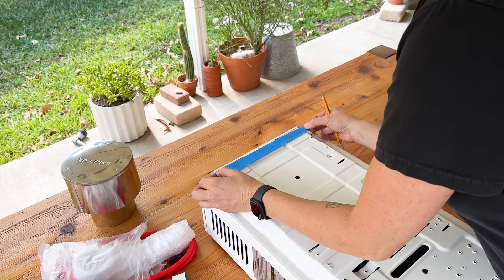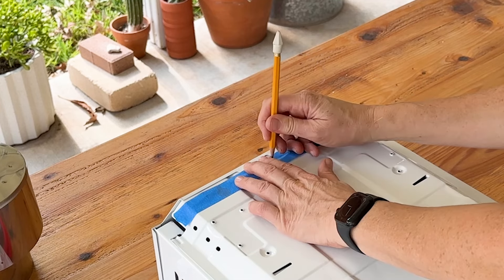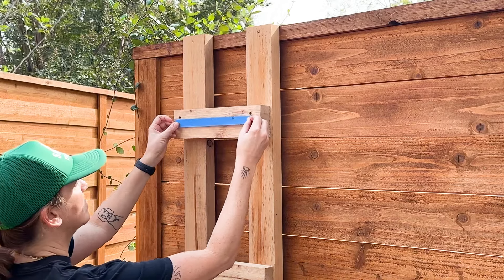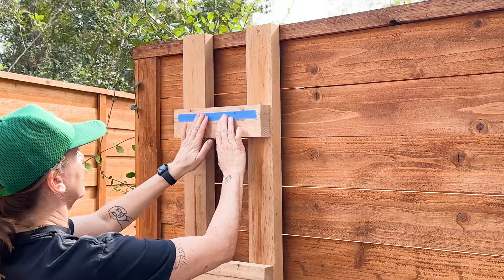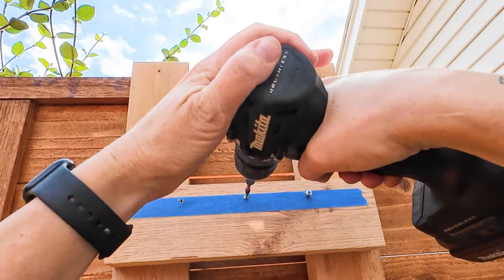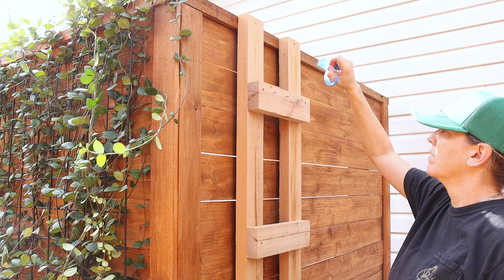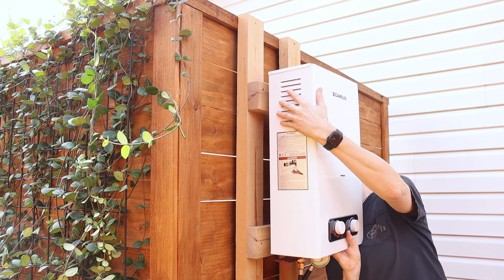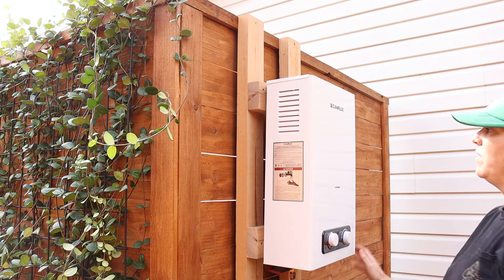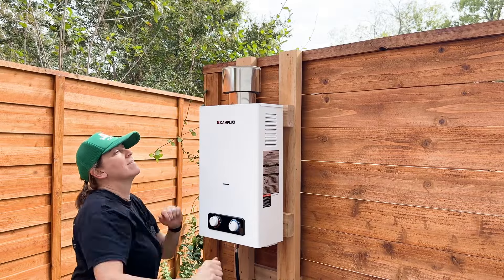This is secured to the shower frame and now I'm adding a couple of 2x4s horizontally that will actually hold the heater. To hang the heater I'm going to use one of my favorite tape tricks — on the back side of the heater there are three keyholes that I covered with one strip of tape. I poke holes in the tape at each keyhole, then place the tape on the board right where I need my screw holes to be. Then I attach the rain cap for the exhaust pipe on top and remove the old inlet water connection for the cold water.